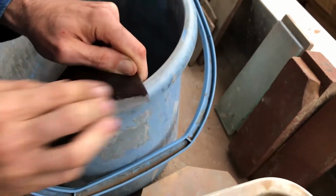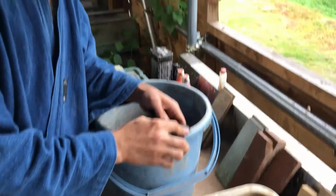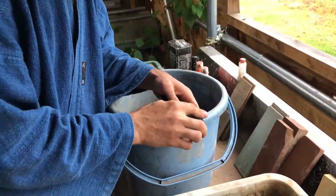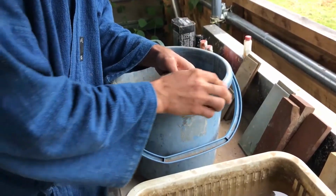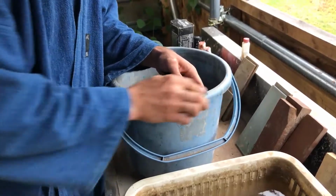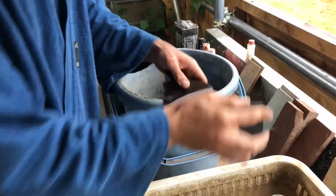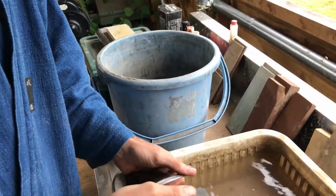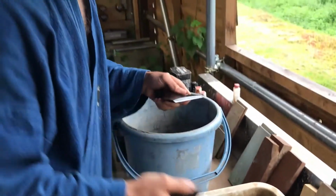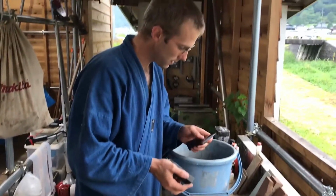But you can start to hit this guy, and when you sharpen it this way, you get a natural curve, because you could get it perfectly straight, but what happens is you fall off here a little bit, and you get a natural curve in the blade, and that's actually great for it. It's perfect for it. So kind of serendipity. If your curve starts to get too much, then you might have to back it off and get it back on a stone like this and straighten it out a little bit. But that's for you to decide.